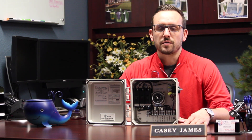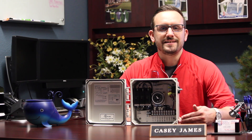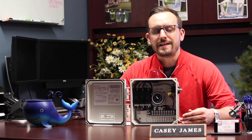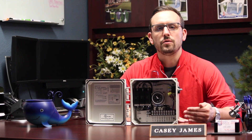It powers the submersible pump through the Grassland 24-hour timer. This allows you to set the time of day that you want the sprinklers to go off. You can set any 15-minute interval between midnight and 6 AM, however you want to set it.